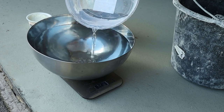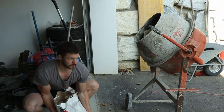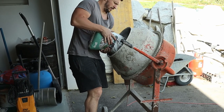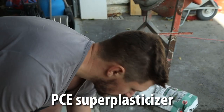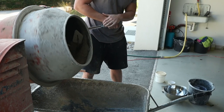And now it's time to pour some concrete. I am by far no concrete expert, but I've had my fair share of concrete castings over the years. The main goal is to keep the water amount to a minimum while still keeping the mixture somewhat fluid. Here I am adding a special additive for concrete — it's a PCE super plasticizer, which makes the concrete more fluid, self-leveling, and gets rid of trapped air.